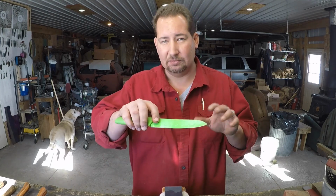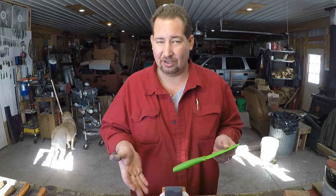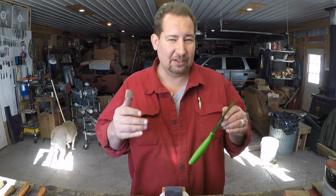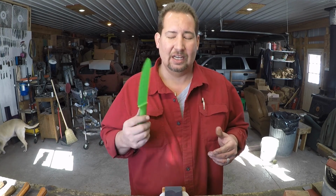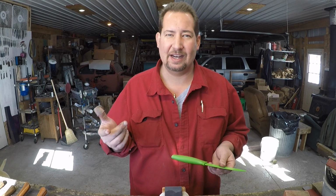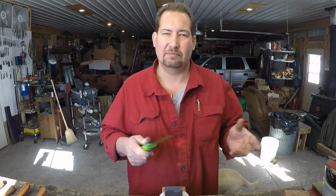I'll go ahead and think about the next video and get it shot. That one will probably start being intermediate knife sharpening. At that point you'll be able to hold a bevel or hold an angle, give or take 5 or 10 degrees, and be able to remove material off both sides. At that time, hopefully you've gotten yourself a stone and practiced with it a little bit. You know what sound it makes when it's cutting, and how hard to push to get the stone to cut, all that kind of stuff. Or we might even go over the mechanics of stones abrading steel off the knives, and then we'll start getting into actually creating a nice bevel and putting it to whatever grit you want, and then finishing it off. I'll decide how we're going to do that.